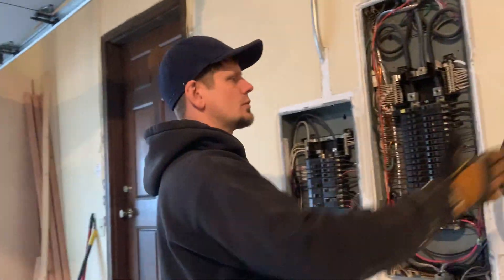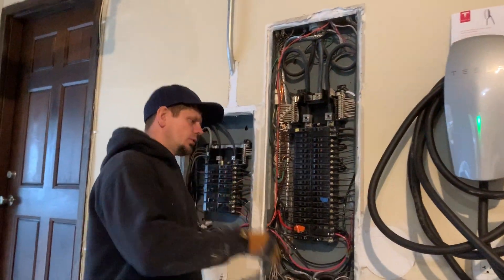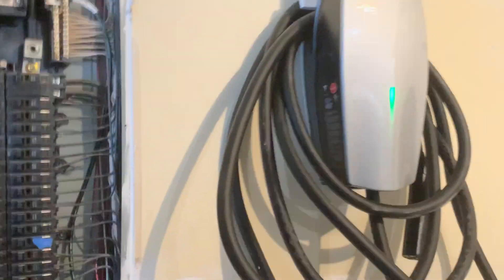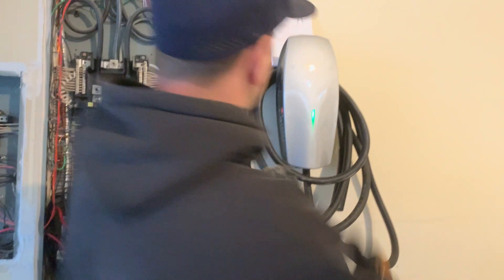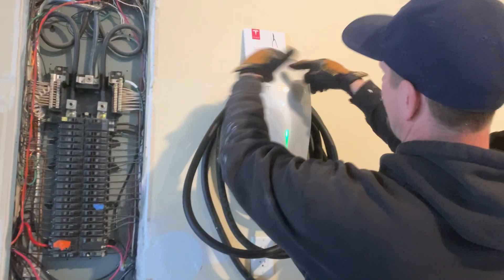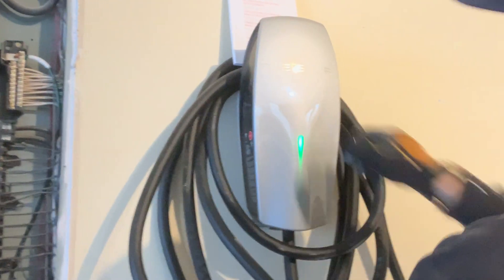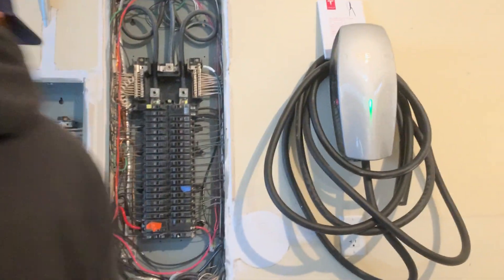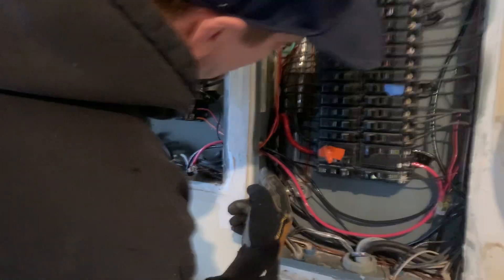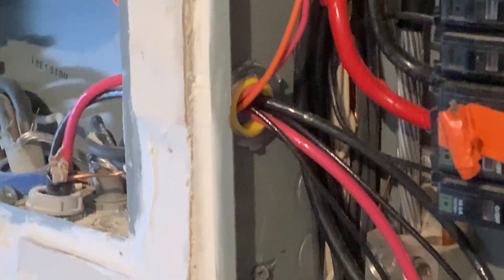This run was short, so I told them let's just do the number four. I did put an FMC cable on the wall right over here. This is why I drilled out a six inch hole, cut the stud, drilled up and through, put a 90 degree connector, bolted that, caulked it, put it on. This basically has one screw — this cover pops off, then there are six other screws that pop off, then you can adjust. I had to drill through the panel and put a bushing because I had to move a couple small things over.